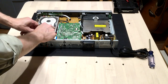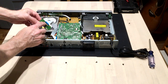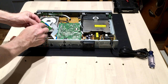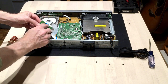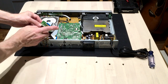Then we want to be careful that this doesn't get snagged on anything. See, it's got that little flat panel connector. You have to be careful, because if that comes loose, you'll have to put it back in. And it can be harder for some of us older people who can't quite see all the contact pins and get it positioned properly. Basically, you have to get it put back in on that little edge right there against the circuit board. You don't want to go too deep, and you don't want to go too far out. And then this little plastic piece right here — the little trap door — usually pops open if this cable comes out. You want to fold it back in to hold it. It holds it snug.